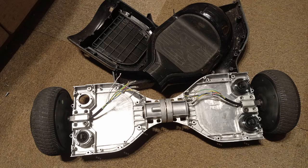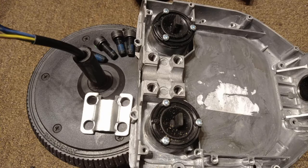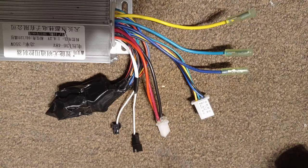I attempted to use the metal frame from the hoverboard, but actually it was more difficult to locate those and keep them vertical than it was to use a wooden bracket. So you only need the motor, the wheel, and the little square bracket with 4 holes that will be used in the wooden bracket, and you can discard all the metal plate frame.